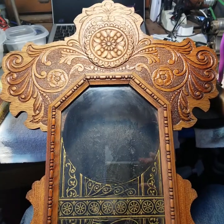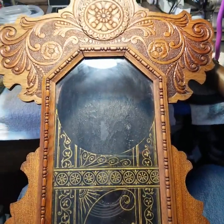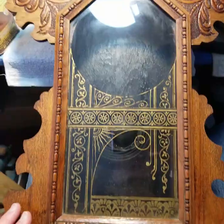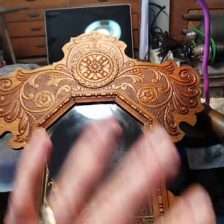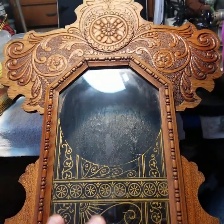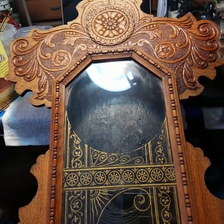I'm going to do a full repair of the clock. Nothing's really broken on it. I've already gone through it briefly. I started cleaning the wood of the case — I've already oiled it. I'm using denatured alcohol first, and I wipe it all down. It takes off a lot of the excess varnish. There were clumps of varnish that had actually faded, and what it does is dissolve that varnish and spread it out really nicely.